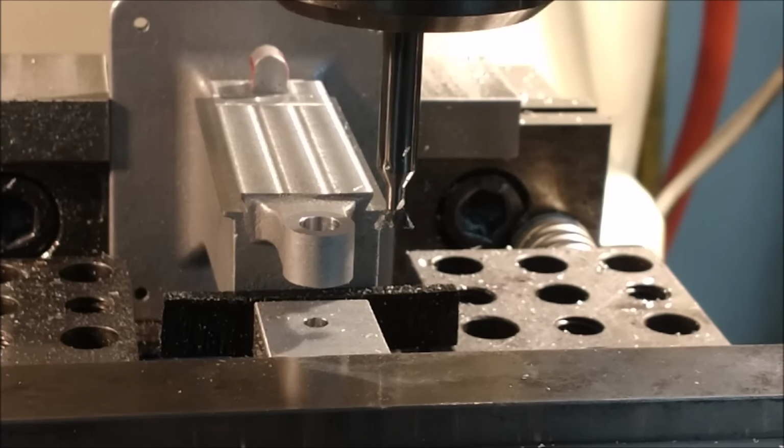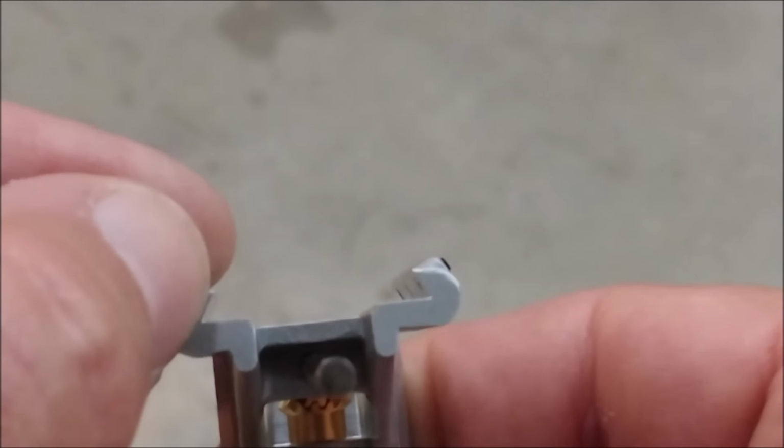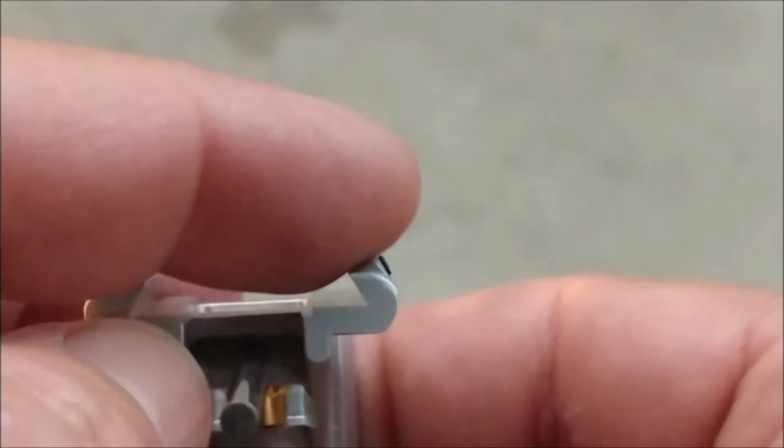Okay, now the dovetail right now is about 5 thousandths out in every dimension, and this is decision time, where you're going to bank the knee from. Let's take a look at the knee for a second. If the bottom of the knee were flat, it would be okay to bank on the bottom and the inside here and leave the top clear. But obviously with the